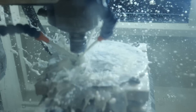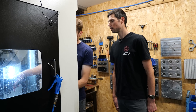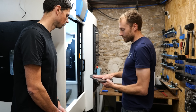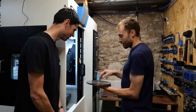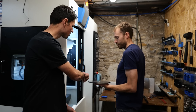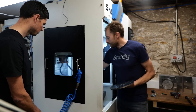This initial program took just 30 minutes to complete, and as you can see the machine is continually flooding the area with liquid. This acts as a coolant and lubricant to extend the cutting tool's life and also to help remove the material that has just been cut away. Now the stock is ready, we can make a chainring. Now we know that this plate here is the thickness that the computer thinks it is, and it's got some features in there that are going to allow us to keep track of where the part is, so that when we've finished the first side we can flip it over. We can put this back in with some additional features on the plate which are going to allow us to locate it using dowel pins.